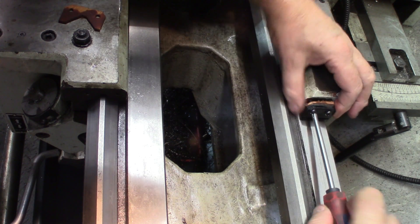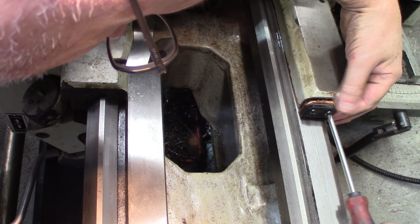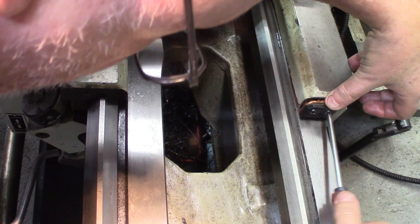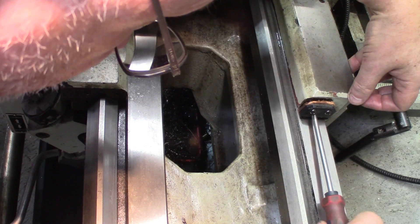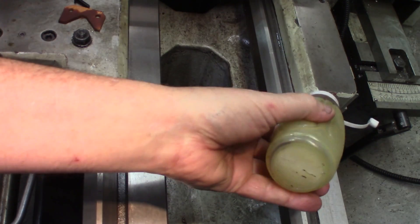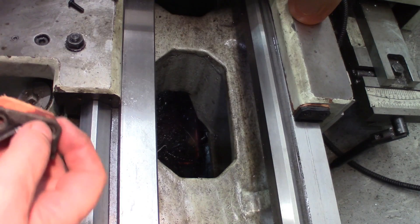It's a little higher so you've got to press it down a little bit. And before you totally put the screw in its place, start the second one — there you go, they're started. And to complete this, this is way oil. Way oil has a tendency to be pretty sticky compared to other kinds of oil. Same thing on the other side.